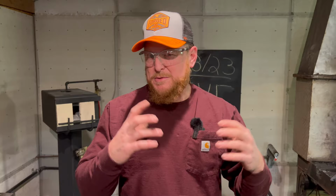When you're putting a fuller in or some other way that you're doing it, you can put a bunch of different dies in here for tenoning and for just flattening things out. You can do guillotine tools with butcher dies. You can do fullers, a bunch of different sizes as well. And this one is a C-frame guillotine tool.